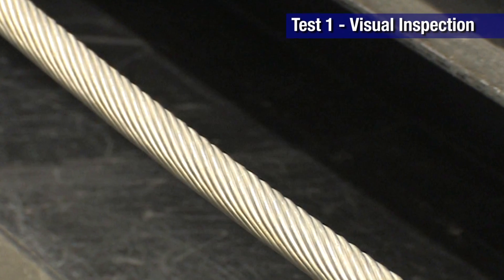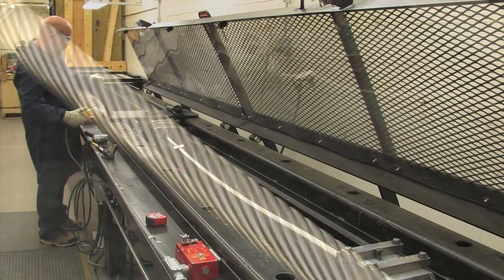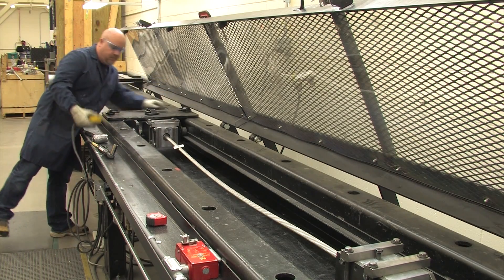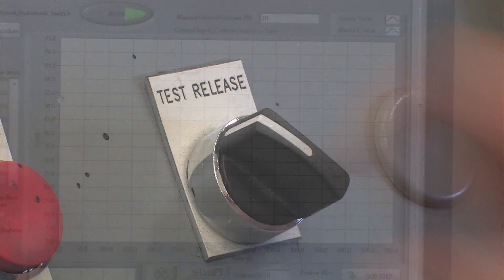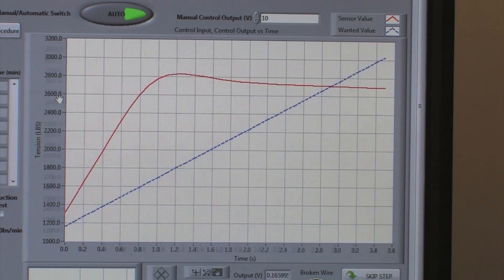The first thing we did was to visually inspect the ACCR. The results did not show any signs of corrosion or pitting in the outside aluminum wires or in the core wires. Next, we shipped the conductor back to St. Paul to test the strength. We tested two samples of conductors using a cable strength tester. The rated breaking strength of ACCR Hawk is 19,200 pounds. The strength of the conductor that had been installed and operated in this heavy saltwater environment ranged from 105% to 106% of the RBS.